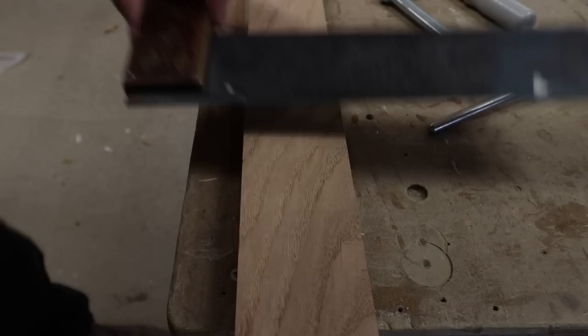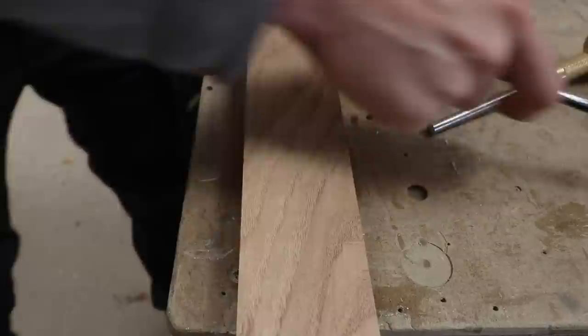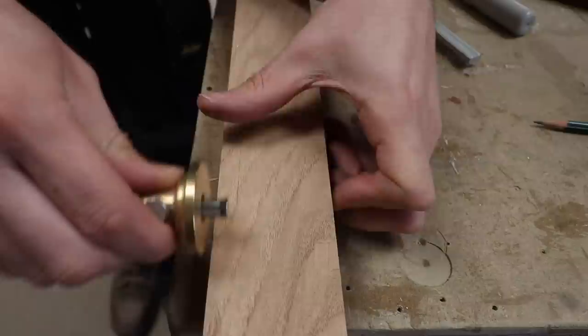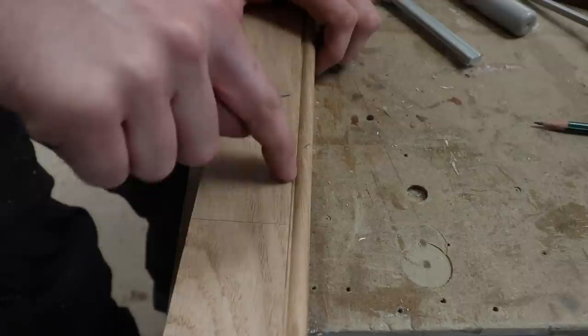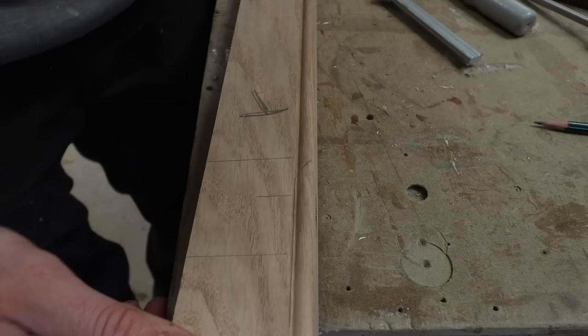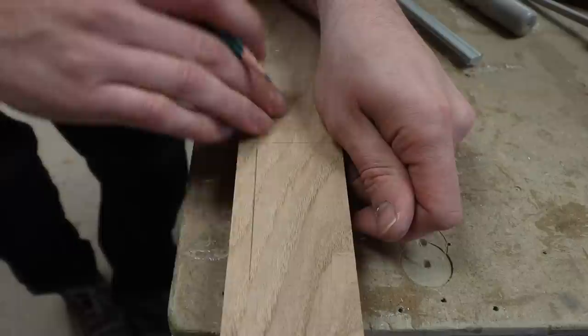You can get a nice little Morso machine that will notch this for you. It's a guillotine, but it's got a flat tooth on the front of the mitred guillotine plate, and you set this depth here, and you push it up to the plate. It'll actually chop a flat section away of the timber there. So, a dead handy bit of kit if you're doing a lot of beaded face frames. That's the bit of kit that you want to buy. For me, I just mullock along doing them by hand when I have to do them. Try not to do too much.